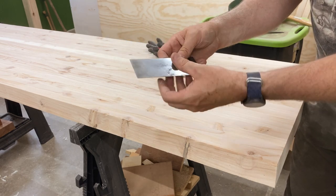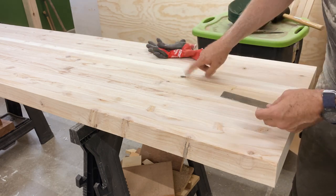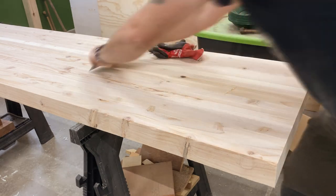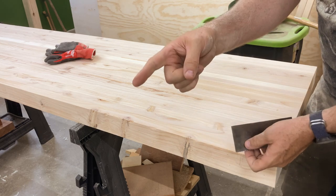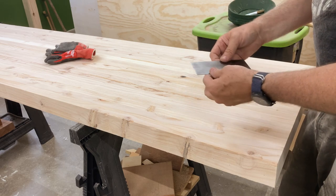This is a great way to get a perfect finish every time. You don't even need sandpaper. This prevents any kind of swirling with the orbital sander or anything. As you can see here, I just scraped over that epoxy, and it's actually smooth to the touch. But I was using it to knock down the higher pieces of epoxy, because if I would have went directly to the orbital sander, it would have made little dips and stuff.